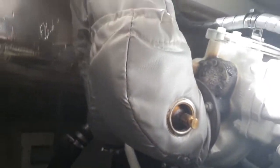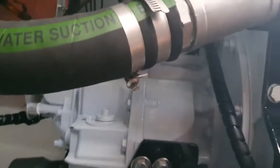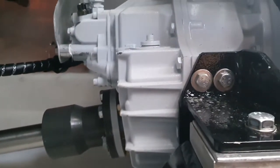We've had custom exhaust risers made because you can see that we need the height and how tight they're actually tied in. Gearboxes previously were very difficult and they were straight, so we've elected this time to go for some down angle gearboxes — some ZF85As in a 2 to 1 ratio in this instance.